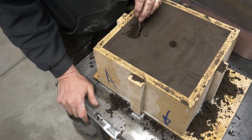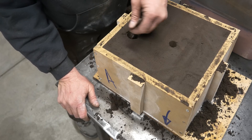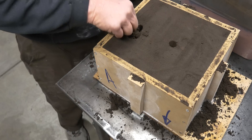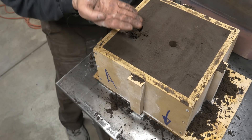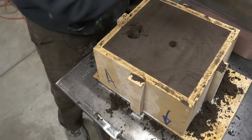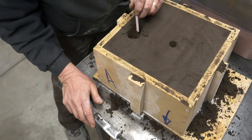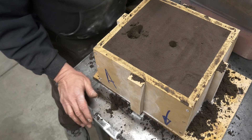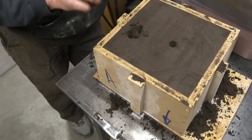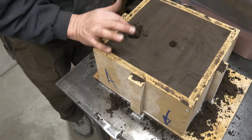This ridge is going to end up being fairly deep — probably about 10 millimeters off the bottom, maybe 20 millimeters from the top. My understanding is that you want the metal to come into the basin, splash and start filling, then run over the top of this ridge. We want to keep the metal flowing over the ridge — never let it starve. Keep the sprue full and keep the metal flowing nice and smooth without any turbulence or air being sucked down the hole. I rounded it off so we have a nice smooth flow over the top.